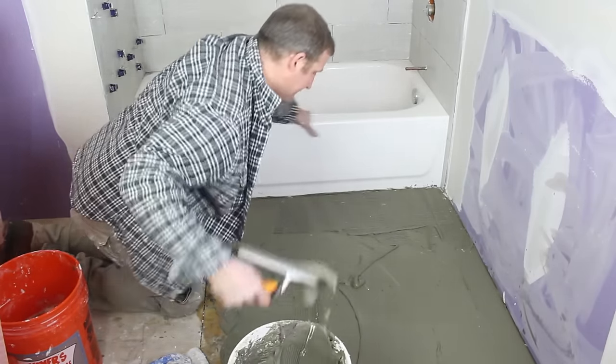Get that layer down, notch it down, and then try to comb everything in the same direction. Making sure you have that quarter inch reveal, use a regular grout float to apply pressure to it and put it in place.